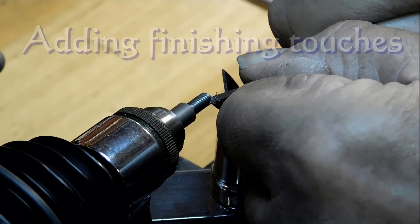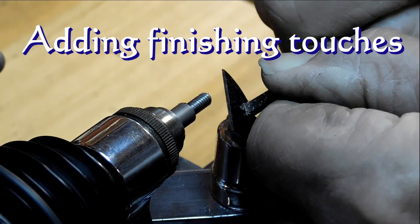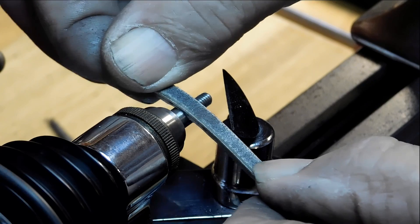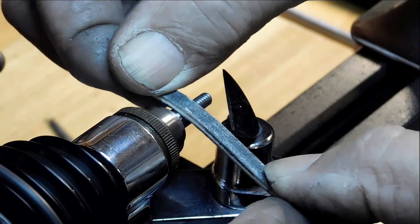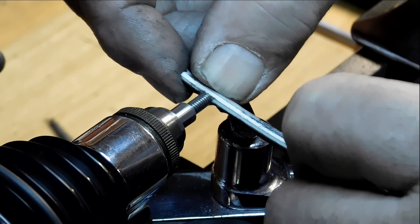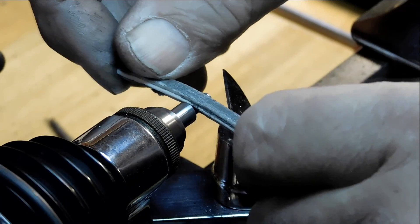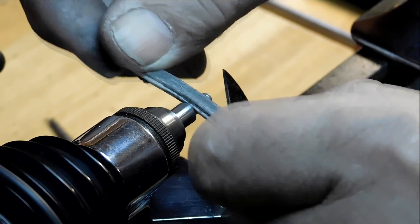There's only a couple of passes. Now we're going to take a graver and round the edges here, put the finisher's touch on the end there, clean it up a little bit. I've got some 1000 grit paper with a foam back that's going to polish it up nicely and make it ready for the next operation. It came out quite nice — I'm happy with that. It's clean.